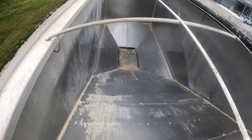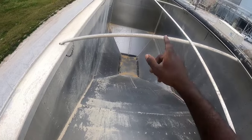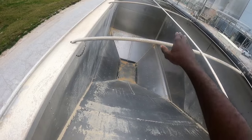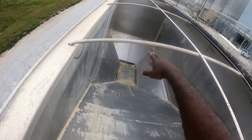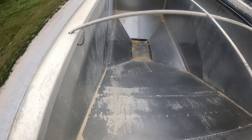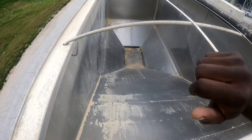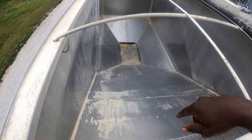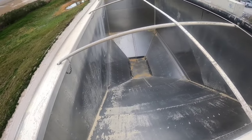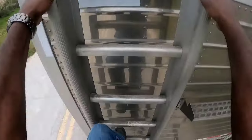Pretty much the same concept as the front door — the only difference is that front wall does not have those two ridges. Typically I try to get a little more weight on the tandem of the trailer than on my drives. Don't go overboard, because it will make for a rough ride if you do.